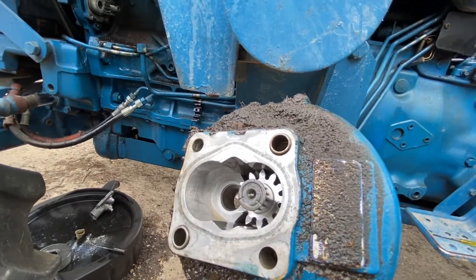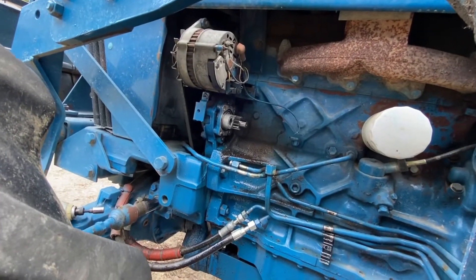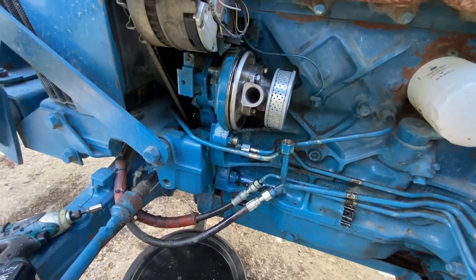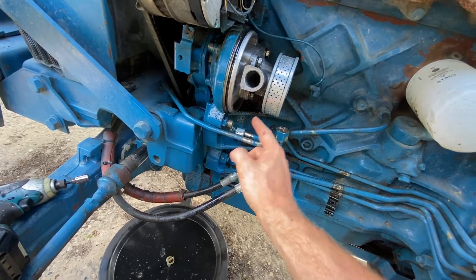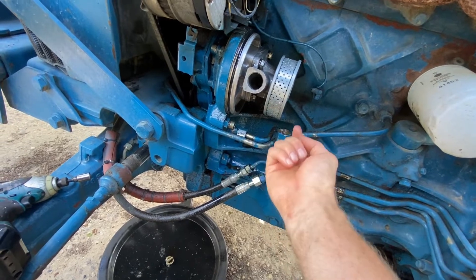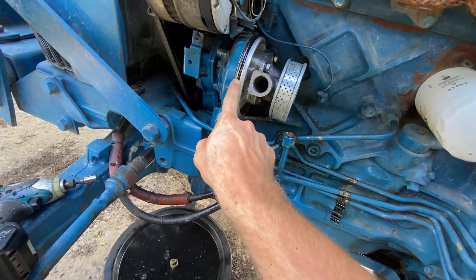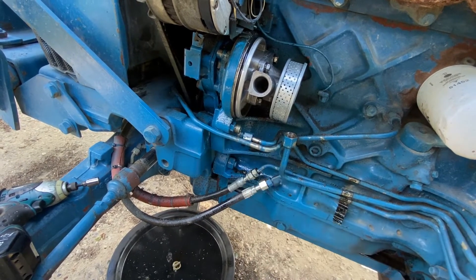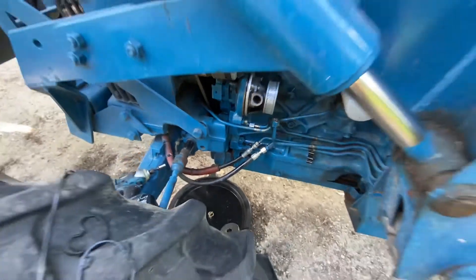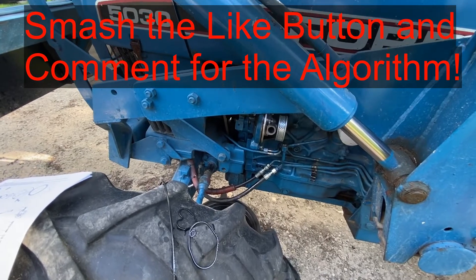If the gear falls out of the back of this piece here, it goes not in the spot where the other gear is. Now I'm just reassembling. Remember to reattach this line before you put the canister back on. I'm replacing this O-ring, and I'll also replace the O-ring on the outside of the canister here. And don't forget about this big O-ring here. But that's pretty much it. If this video was helpful, smash the thumbs up button, leave a comment down below, and thank you for watching.